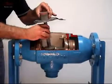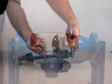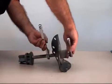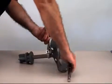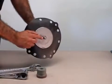Relief valve servicing, 2½ inch through 10 inch. First, remove the relief valve assembly. For easier serviceability, the relief valve assembly simply unscrews for easy removal of parts. A wrench may be needed to loosen the piston from the stem. Inspect O-rings and diaphragm for damage and embedded debris.